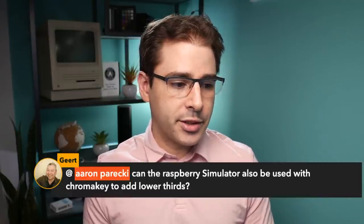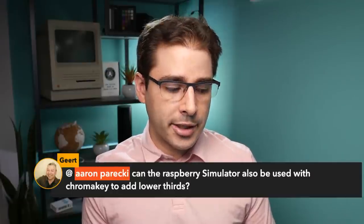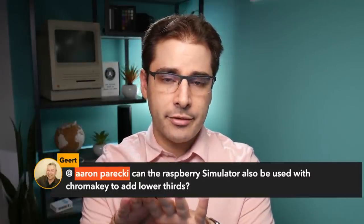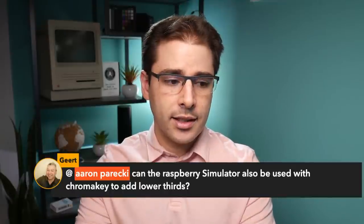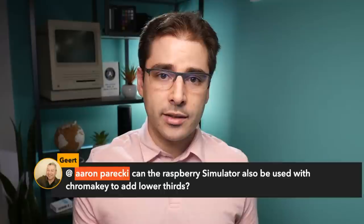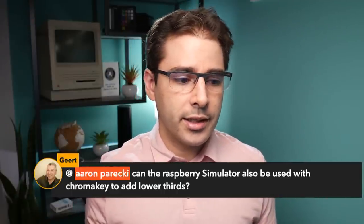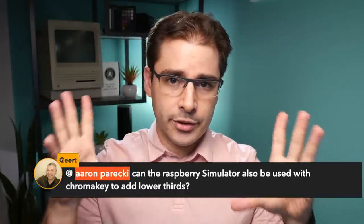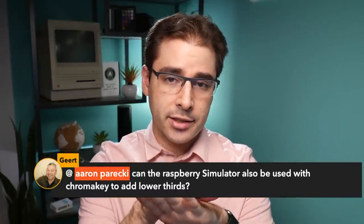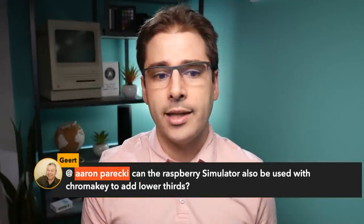The only difference between that and the Hyperdeck is that the Hyperdeck supports splitting out a video with an alpha channel into two signals, and this does not yet. I guess he could do it, but that would take a lot more processing on the Pi. I don't know how that would work. But it's only playing a video clip full screen, whereas the Hyperdeck can split the alpha channel into a separate feed, so you can do proper keying on the ATEM.